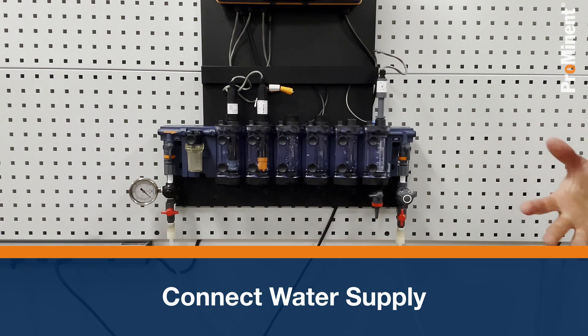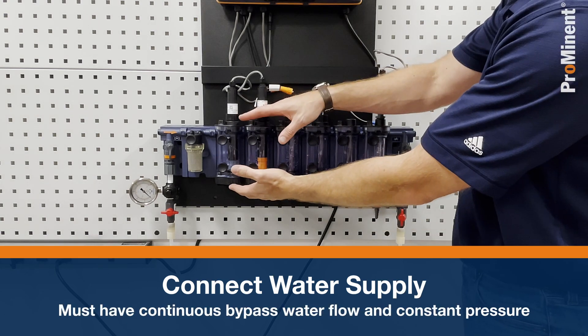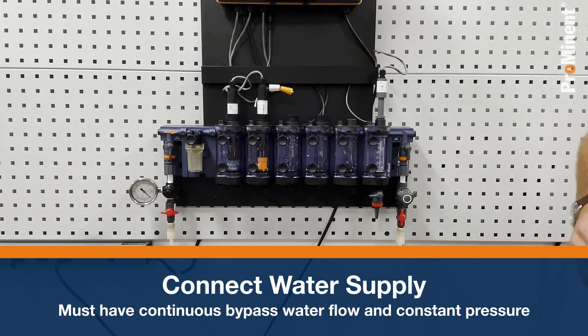— we're looking to get a bypass of our processed water. That bypass of the processed water should provide constant flow and pressure, especially if you have amperometric sensors with membranes on them. These sensors really want to see a constant flow and pressure coming into them.